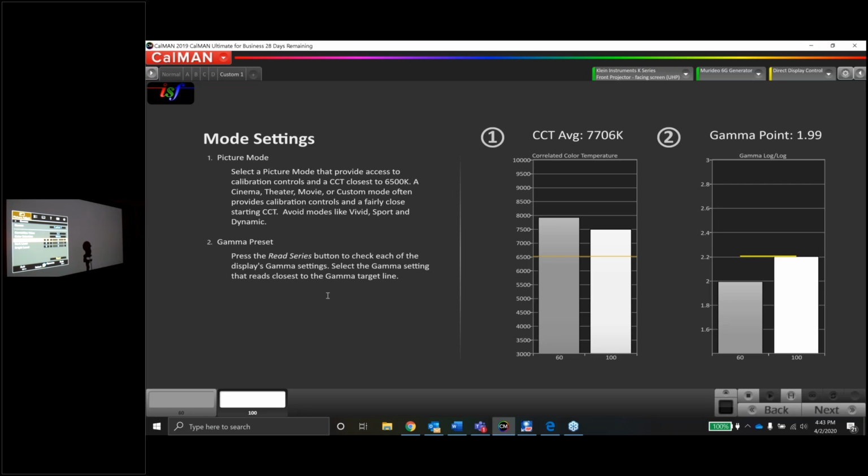It's an analog panel. It goes through basically a shift with time, and this shift typically happens somewhere between about 100 and 200 hours. And what happens is the factory gamma goes really wonky, and that's why you're seeing such a big divergence. If you were to pick 6500 or a certain gamma, you'll see it more with gamma than you will with grayscale.